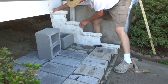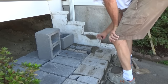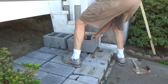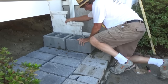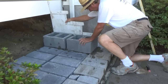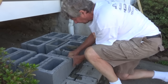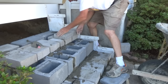So I have my pattern up here again — I've got to put an eight-inch block in here. It's got to be real tight. Check my pattern — that's my height, that's where my stone's going to go, so I keep going. I'm going to continue on, get it in there, real tight joint there. I've got my pattern golden, I've got my four inches; the next one going to be on top of that, it's going to be a three.